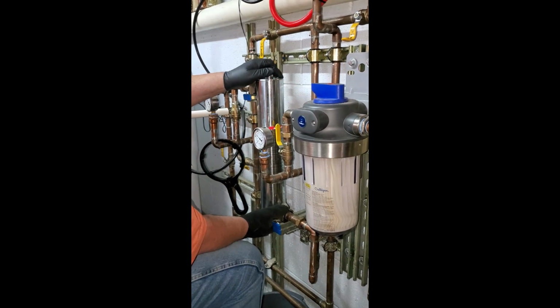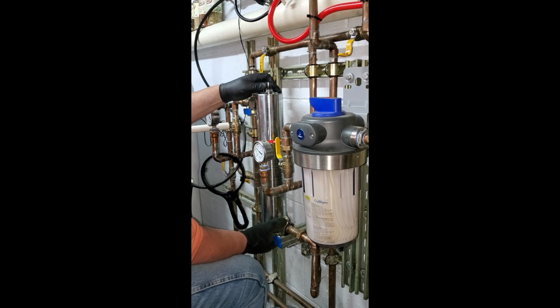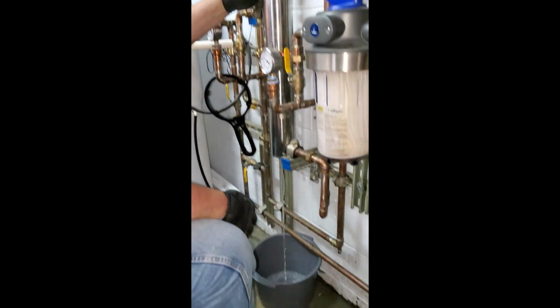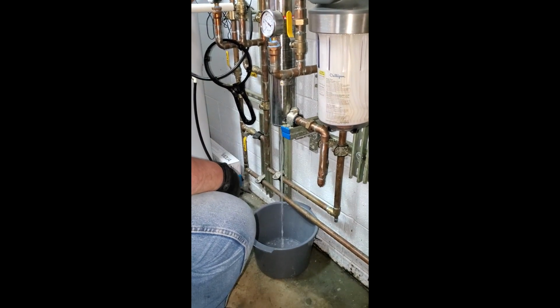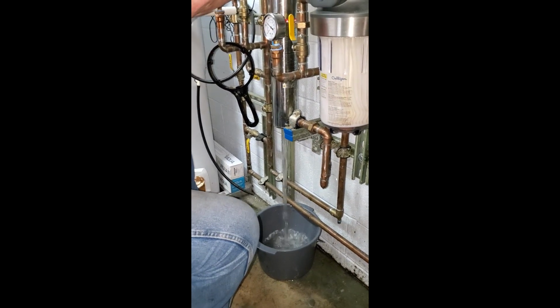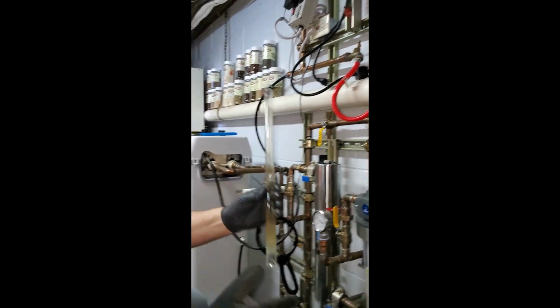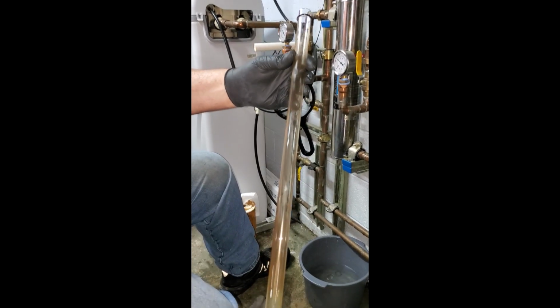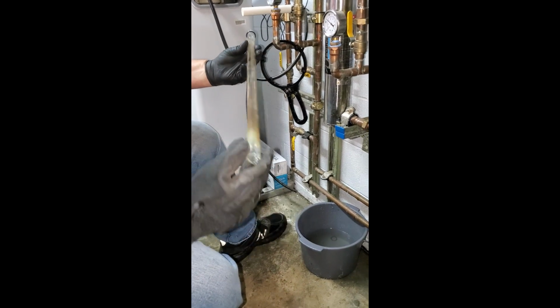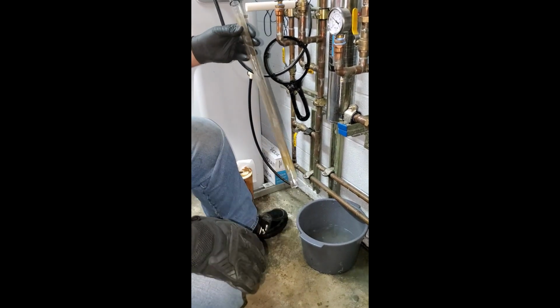And we should see this come up. There it goes. And there's the water. There's the water, and the O-ring fell out. And we can pull this out. All right, so this is why we get a new tube. Can you see all that dirt on there? Yeah. And yeah, that blocks the UV light, so we don't want all that.